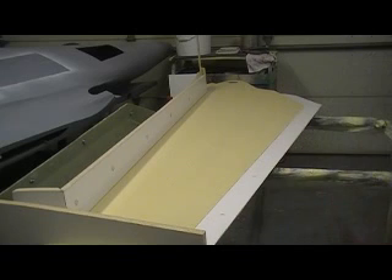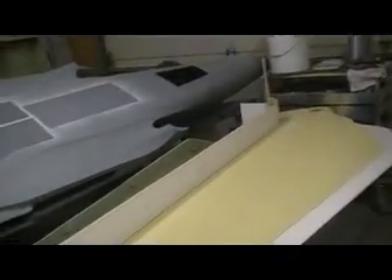That's it for the board off. You open the door. All we've got to do is let that set up and we can start slinging some resin, man. See how that's shiny? It ends up like a coat of cellophane - it's really weird stuff. You can spill lacquer thinner on it, you can scrub it with lacquer thinner, it won't touch the stuff. Hit it with water and it just melts. It's pretty cool stuff.